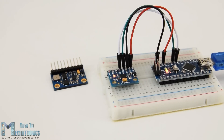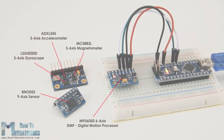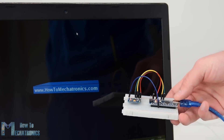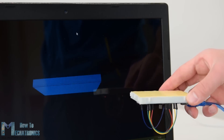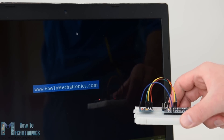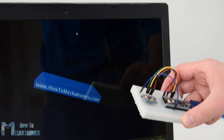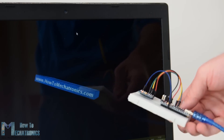For improving the yaw drift, we need to use an additional sensor — usually a magnetometer, which can be used as a long-term correction. However, the MPU6050 actually has a feature called the Digital Motion Processor, which is used for onboard calculations of the data and is capable of eliminating the yaw drift. Here's the same 3D example with the Digital Motion Processor in use. We can see how accurate the orientation tracking is now without the yaw drift. The onboard processor can also calculate and output quaternions, which are used for representing orientations and rotations of objects in three dimensions. In this example we use quaternions for representing orientation, which also avoids gimbal lock that occurs when using Euler angles. However, getting this data from the sensor is a bit more complicated.